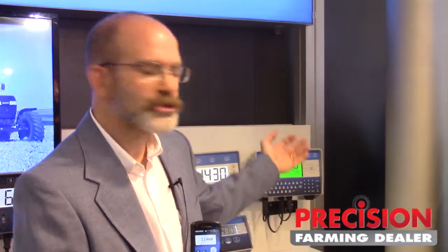The next thing the app does is pull the records directly out of the indicator and put them into the smart device. There's a sync button on the app, and by pressing that button the records go from the smart device to the cloud — to an online version of Digistar's Harvest Tracker software. From there, it's just a press of a key on the PC version to draw those records back down onto the farm and pull up reports.